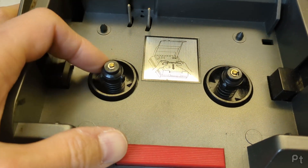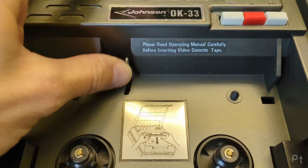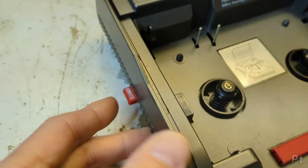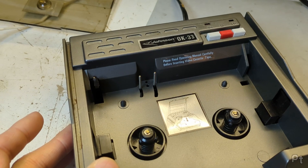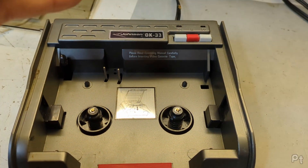It's got what look like legit real reel tables here, which is kind of neat. And it's got this - what this is, is you can mount a little cleaning felt up here and then engage this cleaner button when you hit one of the modes, and it will load the tape up against the cleaning felt.